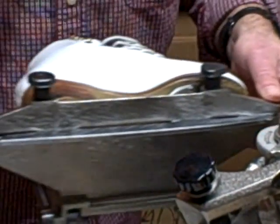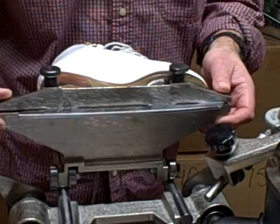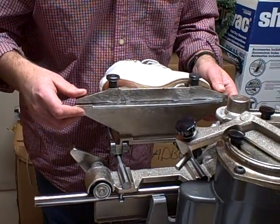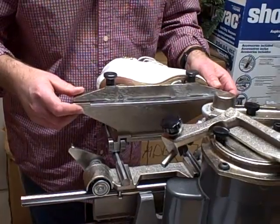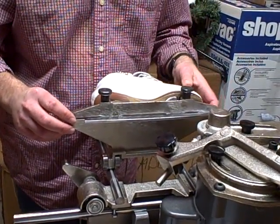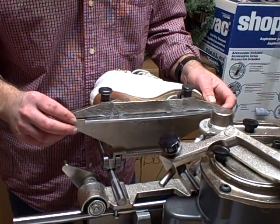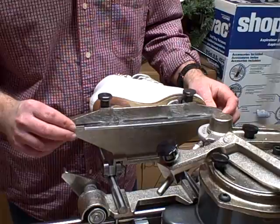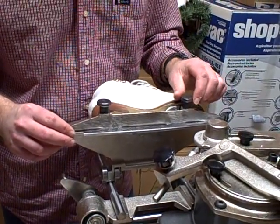The other item is the precision bearings in order to get the skate up to the grinding wheel. During sharpening you just remove the minimal amount of material that's required in order to remove the bluntness, and you can find the bluntness on a figure skate based upon the region that actually looks shiny around the edges.